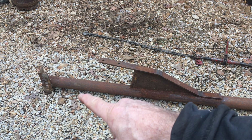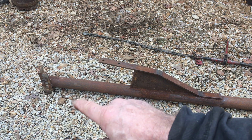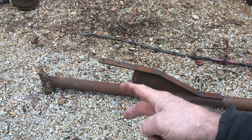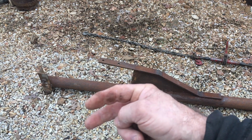If you start off down at the bottom, you see a 3x3 angle iron with a couple of bridge bolts stuck through it. That 580 Case has got a 5/16 webbing welded across a portion of the middle of the bucket, for strength. And so that was very simple to drill a couple of holes in and attach that with those bridge structural bolts right there. They're 3/4 inch. And at the same time, you line up those with the webbing.